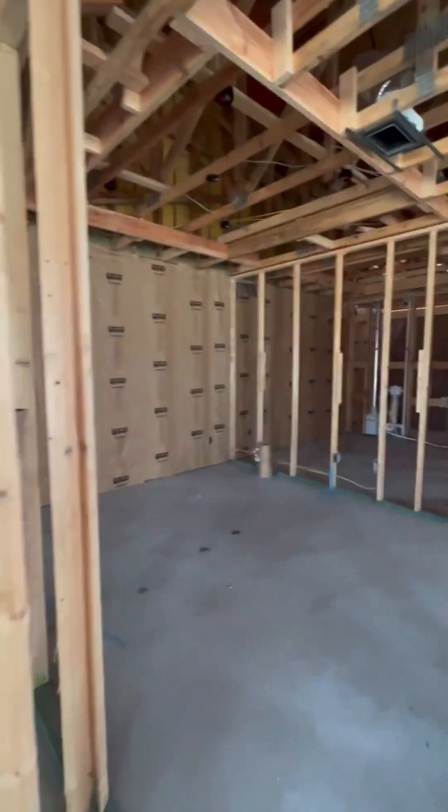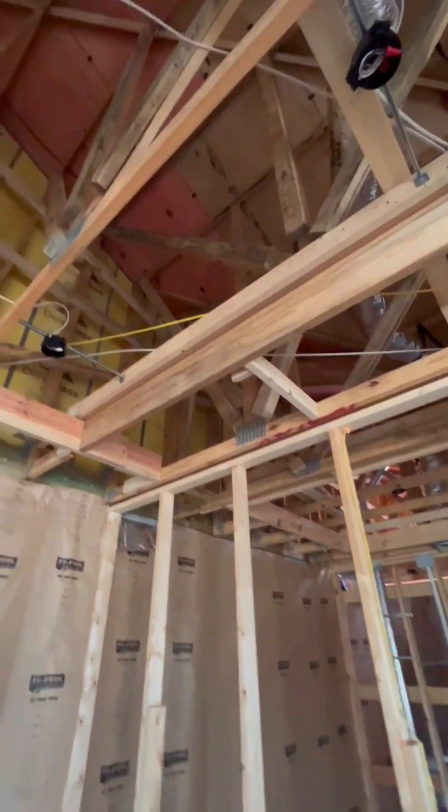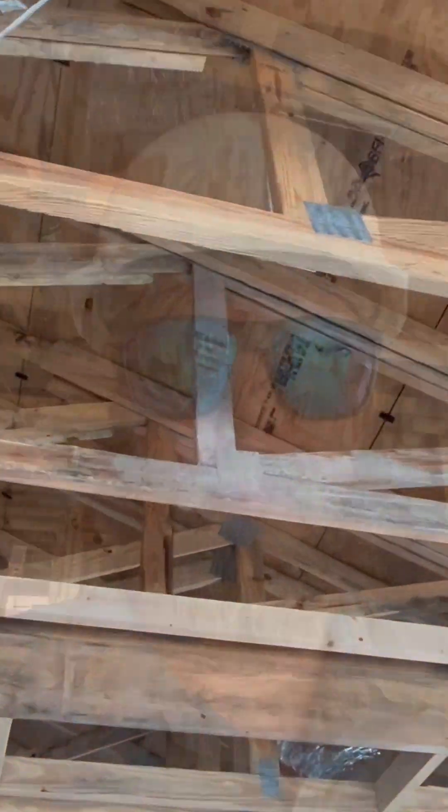Another common thing we're seeing is dirty materials, just due to delays and unexpected deliveries. You can see some of these dirty materials used in the house — this wood didn't come from the mill like this, it came nice and clean without sand and dirt. What we're recommending to clients when we see dirty materials is doing a swab sample. That swab sample will verify if anything is growing and what it is — good documentation to take back to the builder and ask them to do a chemical agent treatment or a wash-down/sand-down treatment.